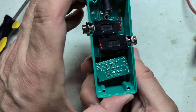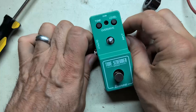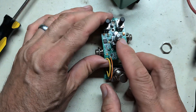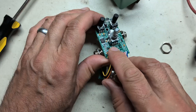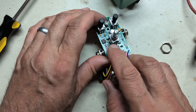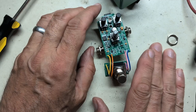Here's the tube screamer — I've partially taken it apart already, just unscrewed this, pulled this knob off, and unscrewed the sides. There we have it. This is our gain pot, the 500k. What we want to do is cut this leg here, and between the top part on the pot and the remaining leg, put a 150k resistor. That should be enough to increase the gain.